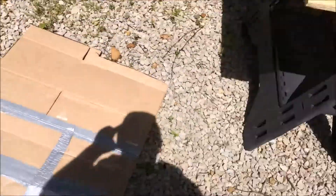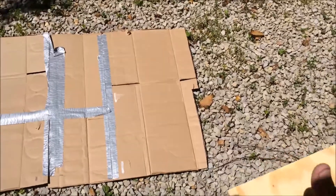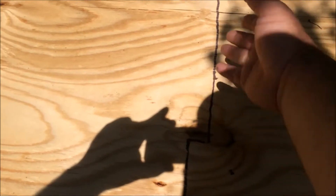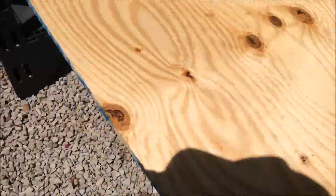What I did is I'm just cutting out the rotten floor. If part of the wood is still good, I cut that section out and I'm just piecemealing the section in. As you can see I've got this line here — this goes all the way underneath, inside the floor, and then this cuts around the little section of plywood that's still good.